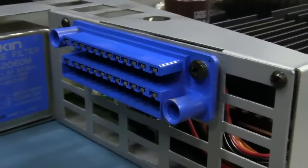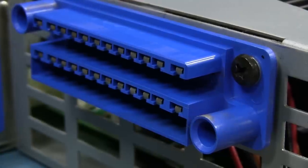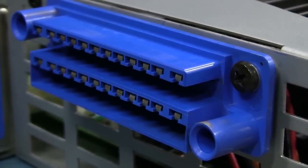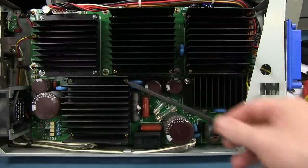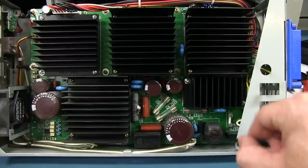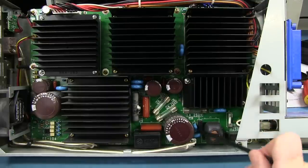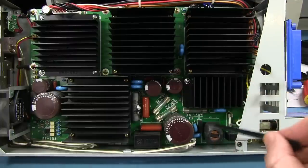And there's the big connector going over to the back plane that's powering all of these boards, so that'd be carrying, you know, like 50 amps total, 50, 60 amps easy. And clearly what we have here is a big switch mode converter with individual switch mode blocks like this. Basically we've got the mains input over here from the filter, and it looks like a common mode filter here. We've got some input protection with some MOVs, I think. No, that's actually some more filtering, and then the main filter cap. So basically,